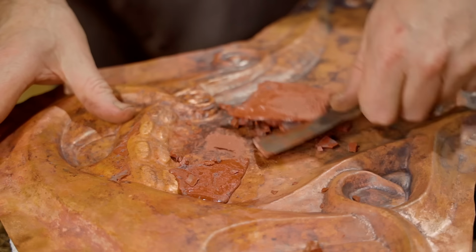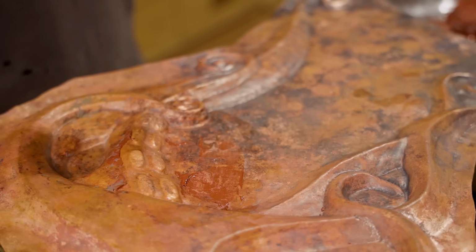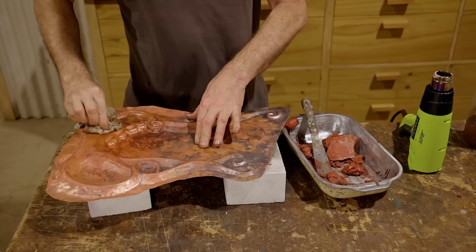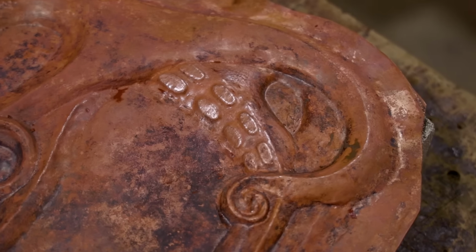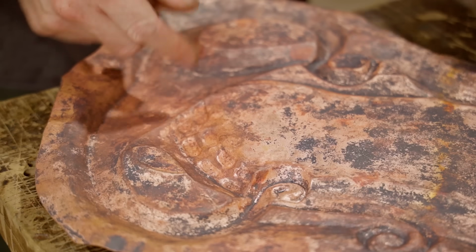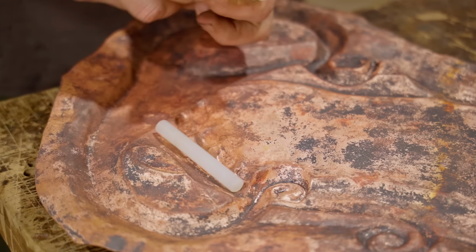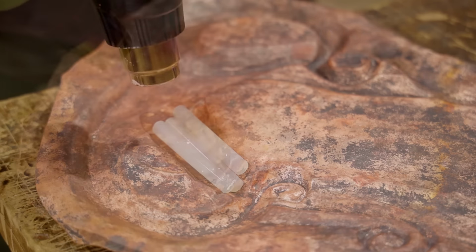The correct way would be to stick it to a large pot full of pitch, but as I said earlier, I don't have anywhere near enough. Also, the pitch is very messy to remove and there's a lot of that to do when constantly flipping the workpiece over from one side to the other. The suckers are starting to form, so to continue, I've decided to try out hot glue as the backing. I haven't seen anywhere if this will work, but I reckon it just might.